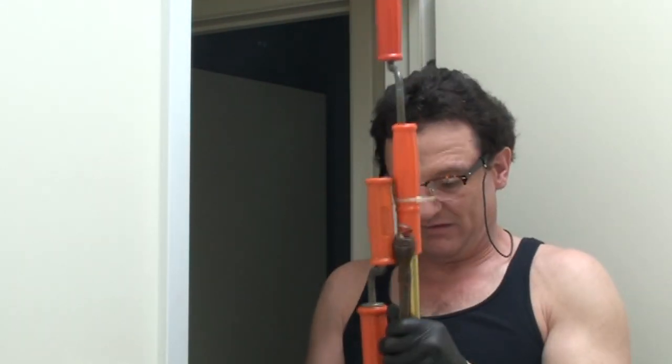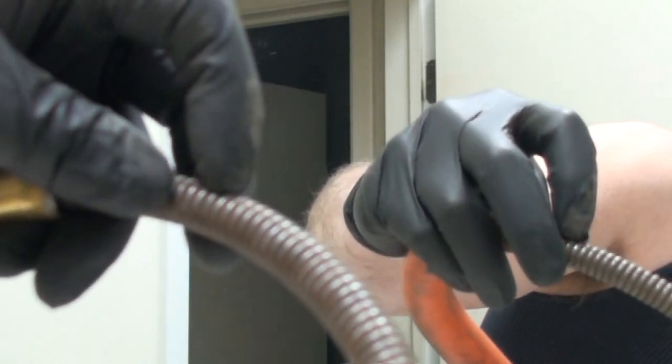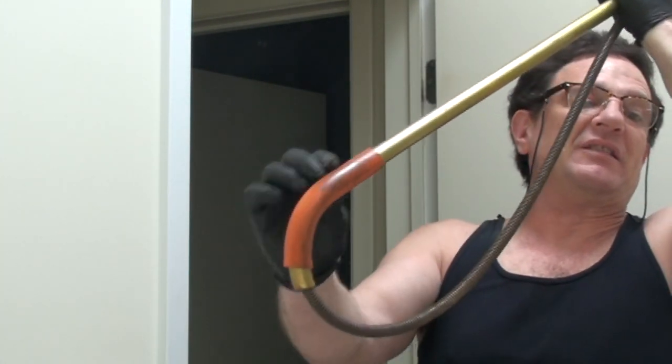It's not as easy as you think to scratch the porcelain inside the bowl and basically ruin your toilet, because it's going to look like you've got a poo stain in there forever — when the porcelain gets scratched, it gets scratched by this heavy-duty coil spring cable, and it's rusty metal. It scratches the porcelain and leaves traces of rust that look like a stain forever. That's why there's always rubber on this bottom section — this is what's supposed to touch the porcelain, not the metal cable.